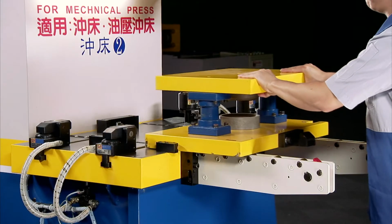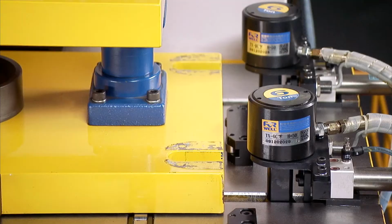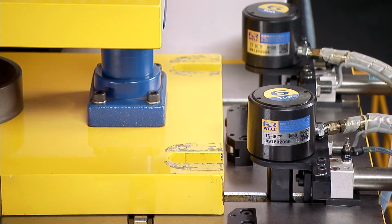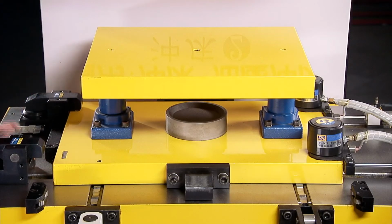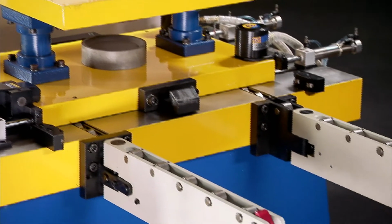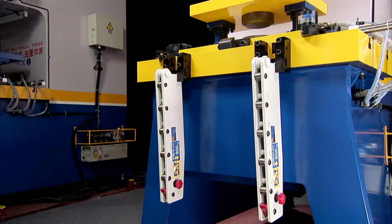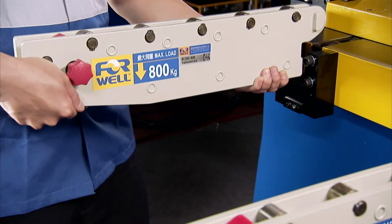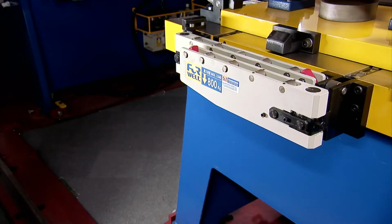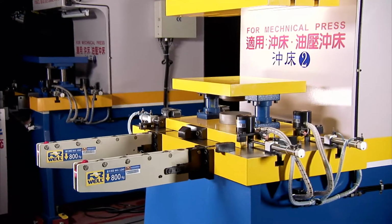One of the first considerations to make is which mold clamp to use. The clamps slide into the T-slots on the bolster and clamp the edge of the die, providing 1 to 50 tons clamping pressure. The die arms offer light, medium and heavy duty applications and come in detachable, drop-down or folding attachment, depending on your needs. They are easily portable and take up little space.